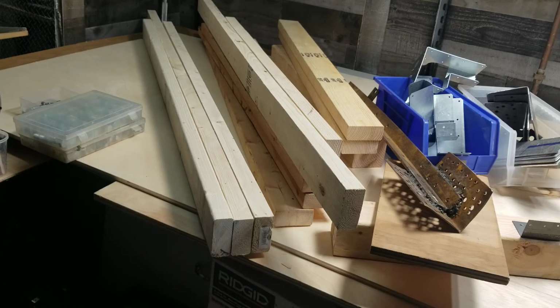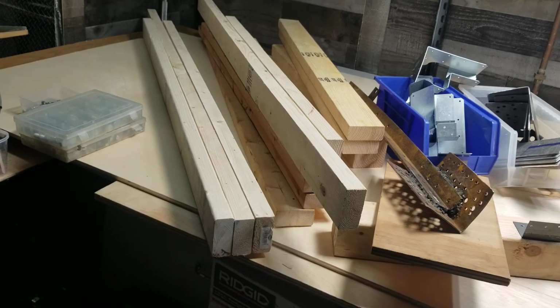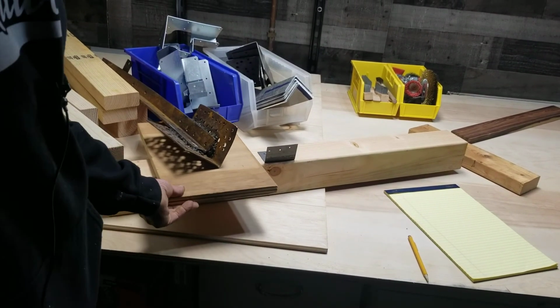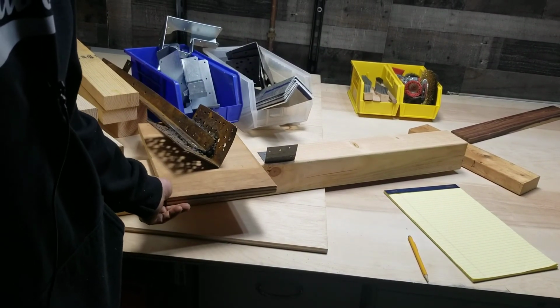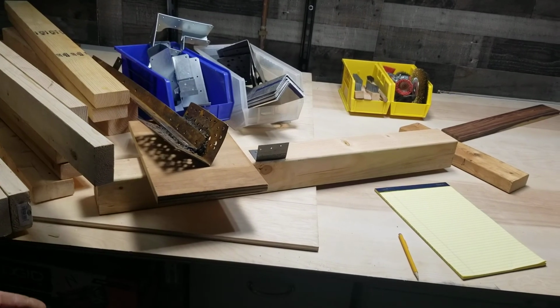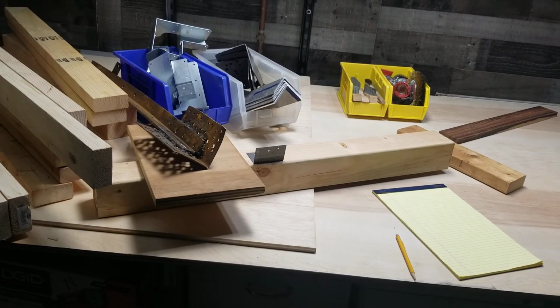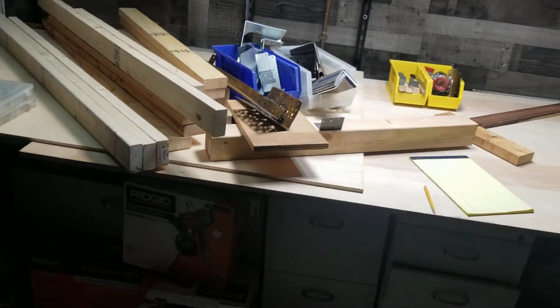What else? There was all kinds of stuff I wanted to talk about and I didn't even really get to it. You know, there's finishing it, picking your plywood, how thick. Do you want to go 3/4, which is what most people go with. They'll put 3/4 and then maybe put something like a 1/2-inch piece of regular OSB and glue it underneath for strength and double sheet it. But with the price of lumber, I don't know about that.